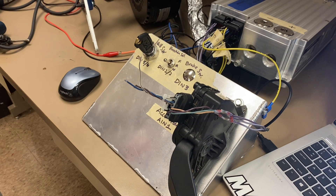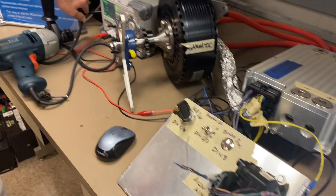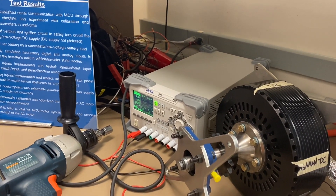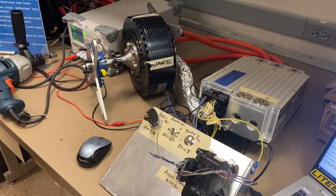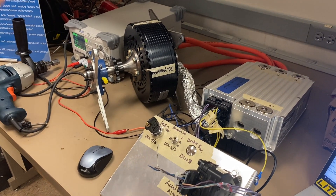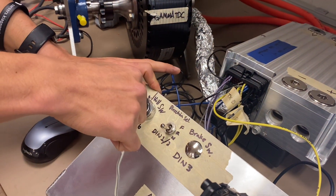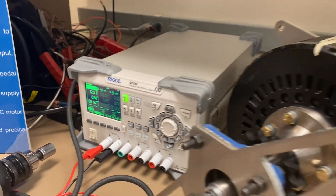This low voltage circuit is powered by a DC power supply. We are supplying it with 12 volts and 2.1 amps as given by Cascadia documentation. Without any power given to it, we get an error through RMS GUI ensuring that we need to meet the requirements. Once we give it power by turning the ignition switch, we can see that we are conducting electricity and power is going into the inverter and its logic system.